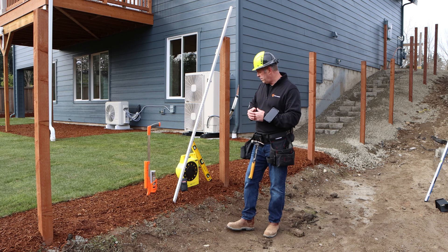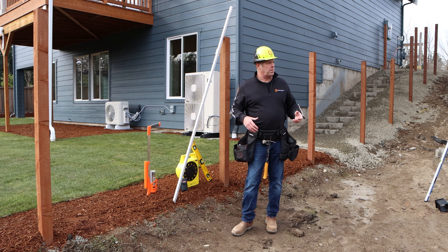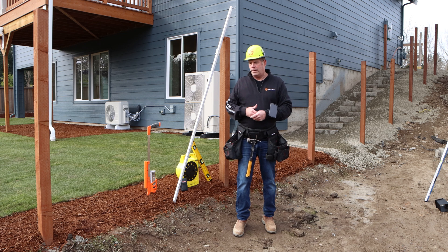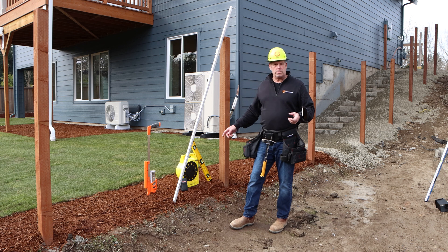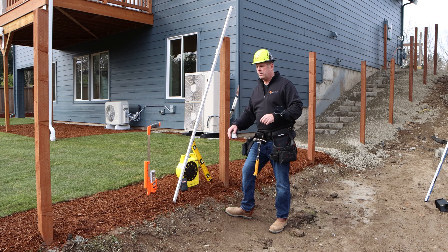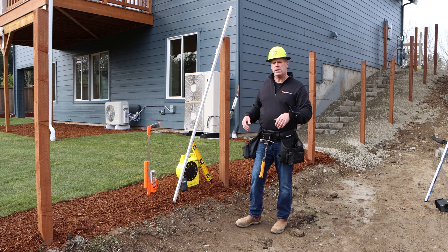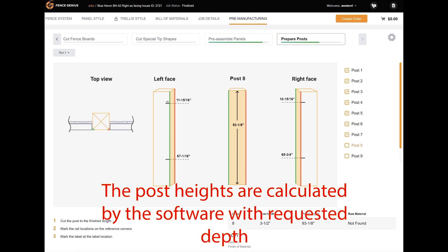Now when you're measuring, you may use a variety of tools depending on the circumstance. If you don't have posts in the ground — let's say you're in a part of the country where you've got predictable soil and you know you can put a post wherever you want, with sandy or clay ground and no boulders and no utilities close by — then you can mark your post locations using the iOS app, the LiDAR app. You can use something like a zip level to capture your elevations at each location. Those elevations are all you need, along with the dimensions of where you've got your marks, and then you can prefabricate everything off-site including the posts, which come to the site already cut to height and you simply install in a daisy chain.